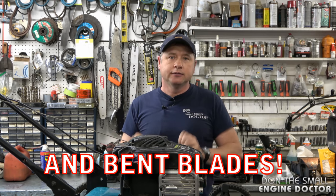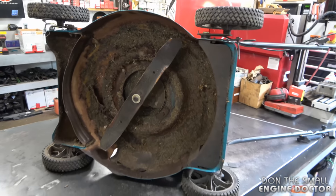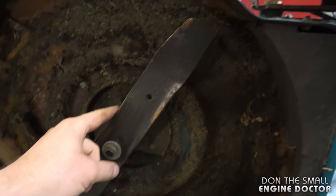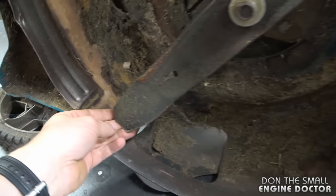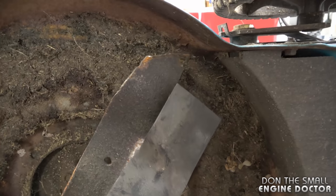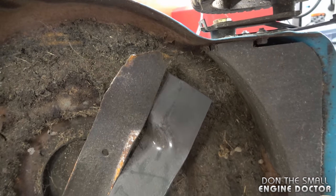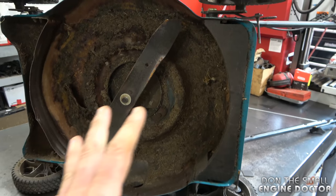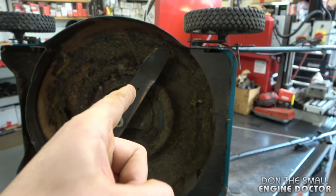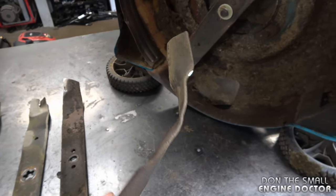The top reason why I see mowers come in my shop that vibrate is because of a worn-out blade or an unbalanced blade. This mower came in the shop vibrating excessively, and if you have a look at the blade here you can see that it's worn out — all the edges are missing parts. Here's what a normal blade should look like: you should have nice square edges, not all rounded and uneven. What this is doing is throwing the blade off balance, and that will cause your machine to vibrate.